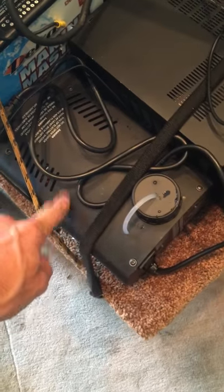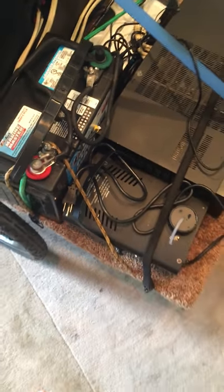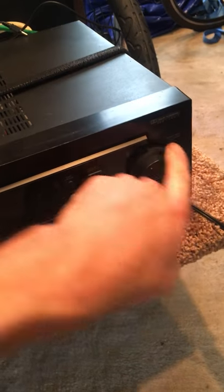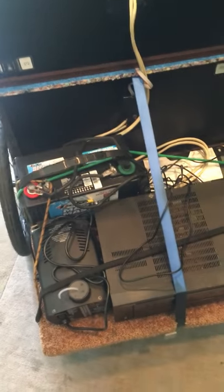As far as the back, this is actually just for transport — it's a fog machine. I pulled it out and put it underneath when I was running it. The battery seemed to hold up quite nicely. This actually draws 500 watts for about 10 minutes at a time because it's a heating element. While this amp was turned to full blast — which I believe is a 150 or 200 watt amp — the inverter was actually showing a draw of over 600 watts for 10 minutes straight, and everything held up great. I'm pretty impressed with those two pieces of equipment, which belong to the RV parked at the moment, so those two will go back to that.